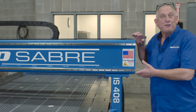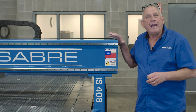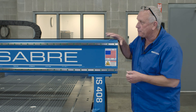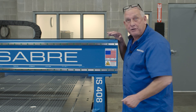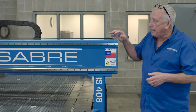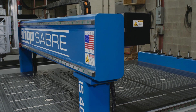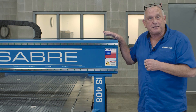The other members of the frame family are the gantry itself and the gantry supports. These are engineered the same way as the base — we're using finite element analysis, structural steel, and really good precision machining. That also enables us to have 12 inches of clearance under the gantry. What you actually see on here are precision guide rails, and they're only as accurate as the machining that's done underneath. That's why we use aerospace mills to do all the machining on these frames.